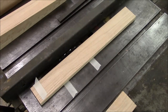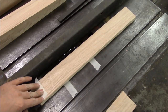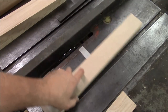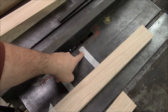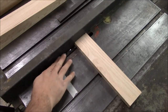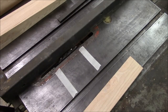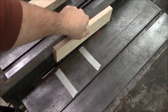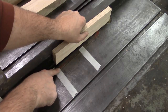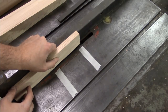The vertical pieces are a little more challenging because I don't want the dado to be visible at the top and bottom, so I basically have to start the dado in the middle and then cut and stop the dado before the end. I went ahead and put some tape down at the start and stop points of the dado blade — that's a distance of basically 4 inches. So I should be able to take my piece of wood, drop it down, make sure the end is past the start line of the tape, feed through, and then stop just before the end.